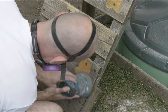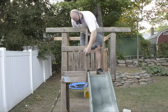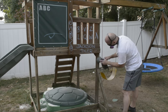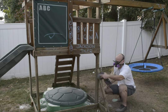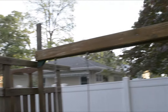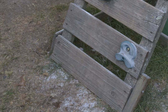If you are going to use a sander like me, just grab a nice low-grit sandpaper — nothing crazy. You don't want to eat away at the wood too much. All you really want to do is remove the splinters, any loose material, any dirt and mildew buildup. And as always, make sure to wear your respirator. You never know what's in that wood. This is cedar, but who knows what kind of stain is in it, and with any pressure treated wood you definitely want to wear a respirator.